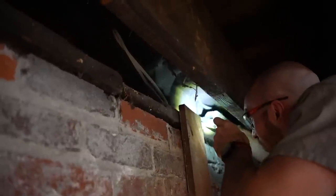The two wires — one is providing power to the receptacle, the other is running from that one to the next receptacle on that circuit on this wall. So I'm loosening this staple, just wedging it a little bit with the screwdriver. It's not even all the way detached yet — I'm just giving myself a little more give so that the wire can slide through it. And we're going to see if I can't just puncture through this fire caulking, maybe create some tension on this wire. I do want to be careful that I'm not rubbing the wire against the wooden subfloor and marring the outer jacket, because that would compromise its electrical integrity.